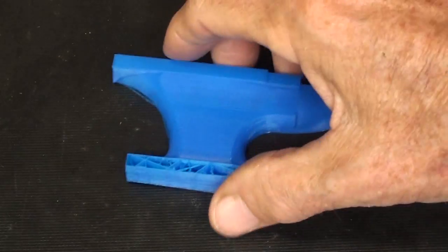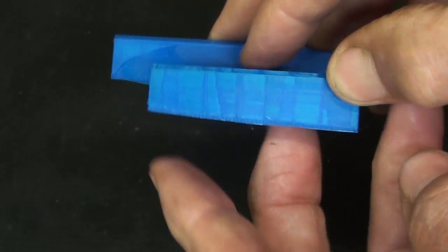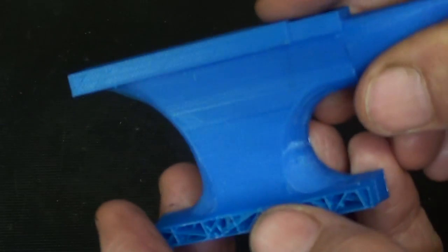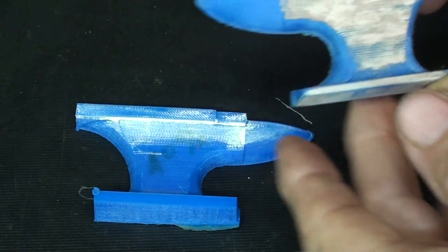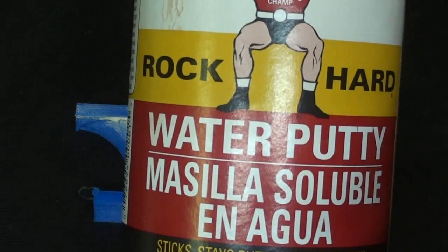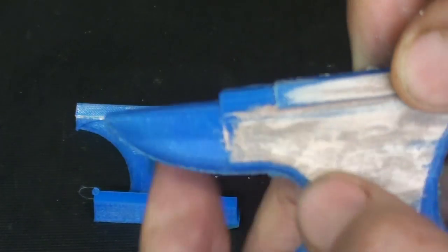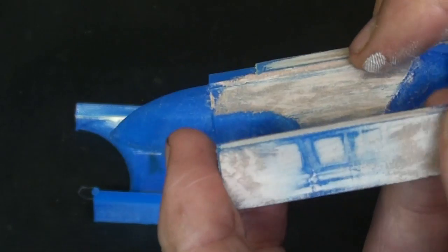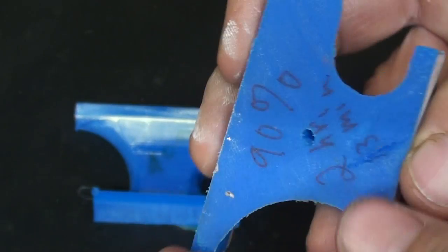I'm back in the shop. Here are a few samples — I made them in different sizes. In this case the filament broke, so it didn't quite finish, and it also lifted off of the platen. That's junk, but it serves to show what the finish looks like. The finish is never all that great, at least on my printer. The material is PLA. Because the finish isn't very good, I also experimented using body putty and Durham Rock Hard Water Putty, which sands a lot easier than Bondo. That makes it real smooth compared to just the printed finish. But this is not one I'm going to use.